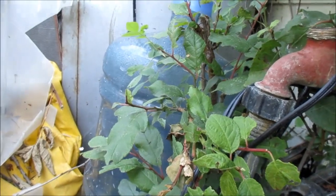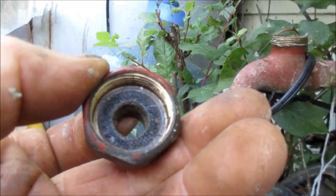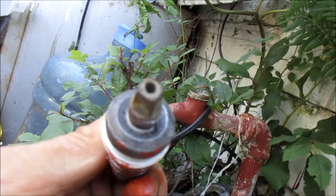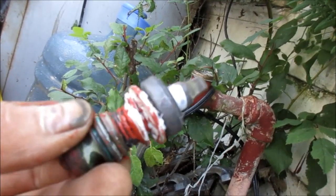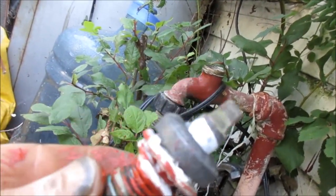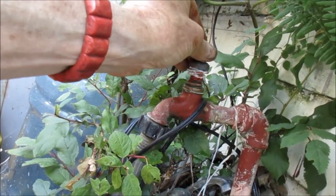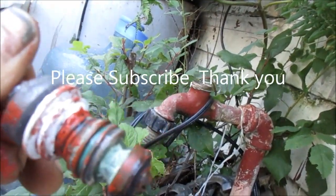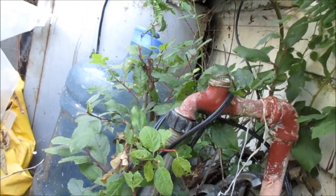This is the packing material right here — it's inside that part. I've got one here: it's a metallic packing, and I actually put some silicone and some more Teflon tape around it just in case. It goes in there, and if you have any grease you might want to put it on the threads. That should be good to go. Thanks for watching.